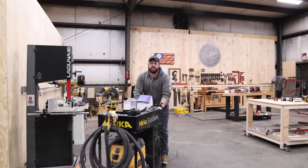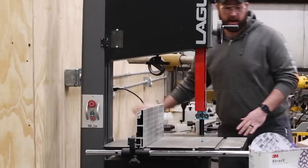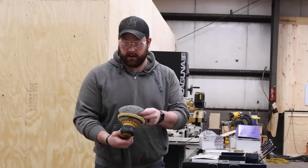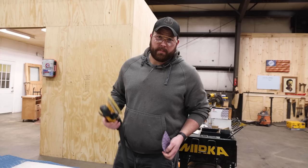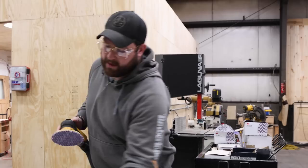It just feels so good to have a shop that has some power to use some tools. We've got some lights and I am stoked. What I'm going to do is hit the bottom side of this with some 80 grit just to rough it off real quick — that's what they suggest. Then I'll put a finish coat on top. Not per their recommendation, I'm going to sand this thing lightly at 220 grit with a soft pad. And I'm going to hit it with some Rubio — I want to bring the sheen down; I'd like it to be a little more matte. Hope this doesn't ruin it.